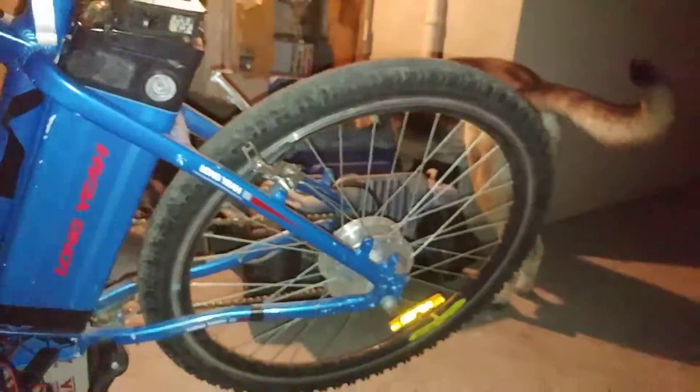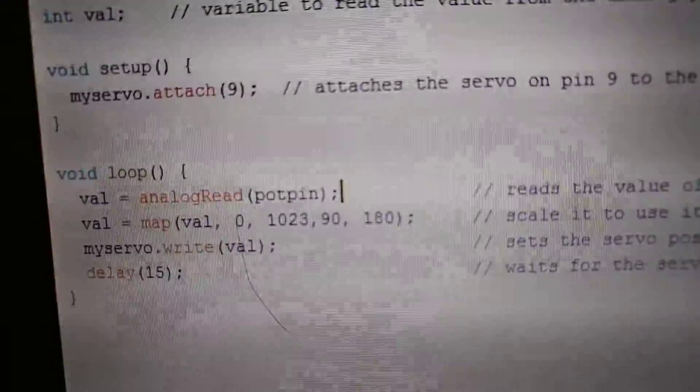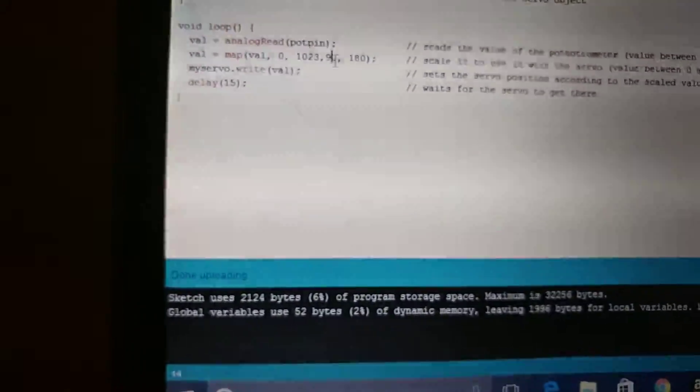So what I'm trying to do is get rid of that negative signal. What I'm doing is I'm slowly changing the code. This right here used to be a zero, now it's a 90. So now I'm making it a 91 to see if I could get it to go down. Upload the code. Okay, it's going at different speeds — I think I've got to lower it.